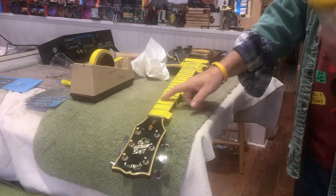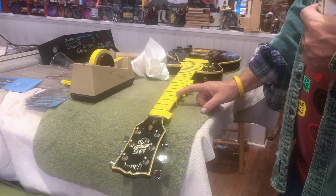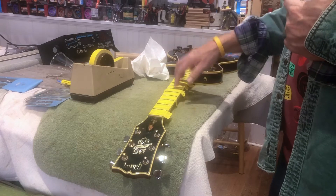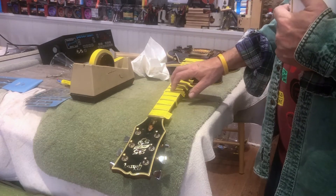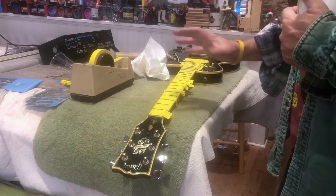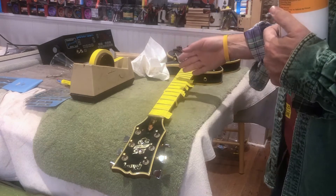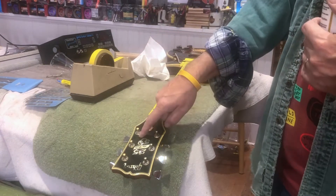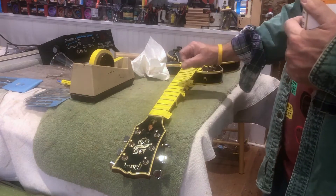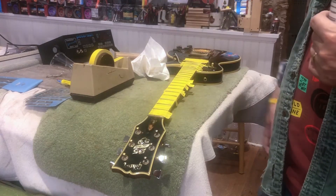Also, the whole taping thing — if you get into one of those maple Fender necks, an older one that's polyester on the board and lacquer on the headstock, don't tape it. Whatever you do. Because when you take the tape off, you're going to take the finish off. You can tell those necks because the headstock clear is going to be darker than everywhere else on the neck — where the lacquer is, it gets darker; where the polyester is, it's unaffected.